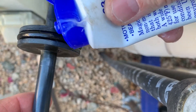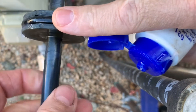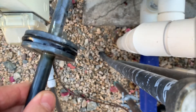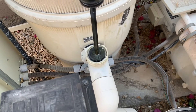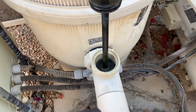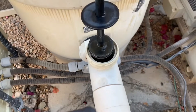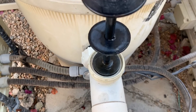These are the big wide fat o-rings — be liberal with the magic lube. It'll lubricate the inner valve body and the o-rings as well. When we put this stem back in the valve body, make sure it's completely perpendicular — don't be off at an angle. Line it up and apply nice firm pressure with a little wiggle, and it'll push down and begin to seat. The first one is in; now push the next one in with a nice push until it will not go any further — then it's fully seated.